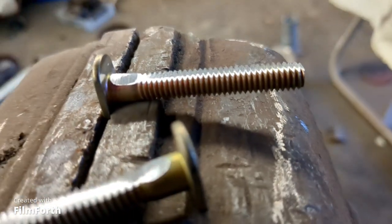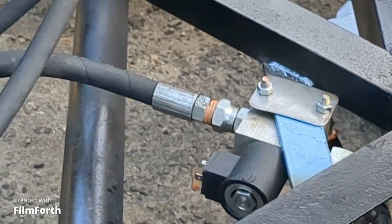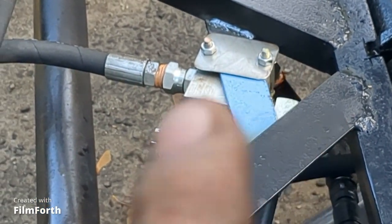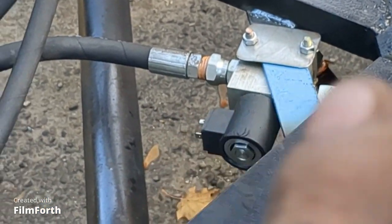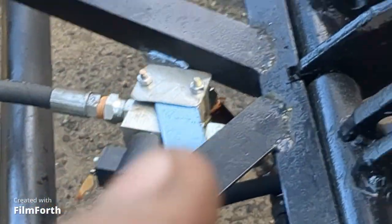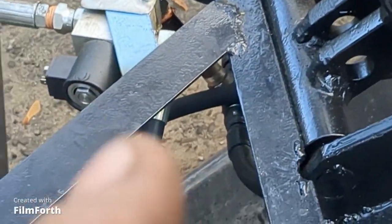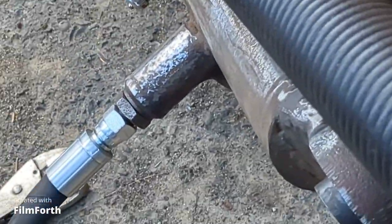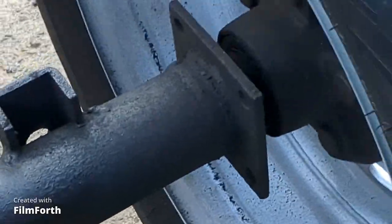I got that valve in with those two bolts — I flattened out the sides of those two bolts so they fit in the slot in the side of that aluminum block, which is what the valve body is made of. The fluid comes from the power pack through the box, gets diverted from those two cylinders, and instead goes into that curly hose right there and gets teed into those two hoses that go to the back — into that cylinder and into the cylinder right here. So now I can extend the cylinder and push the wheels down.